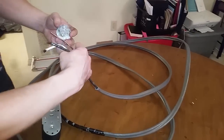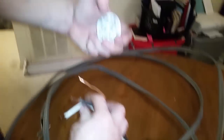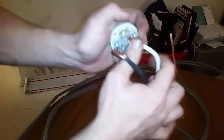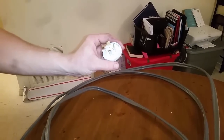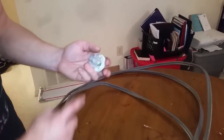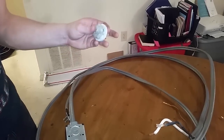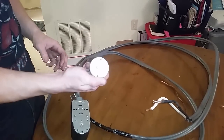For your welder, however, you do not need the neutral. As you can see, this is a three prong wire, not a four prong. So what happens is you use the green ground and you use the Y and the X terminals. You put your wire in there and tighten it down. If your generator is 5k, 6k, 7k, usually it's going to be a bigger plug so you'll have room to put your wire in there. That's how you wire up your plug, which you can use as an extension cord for a generator if it's big enough to support your welder.